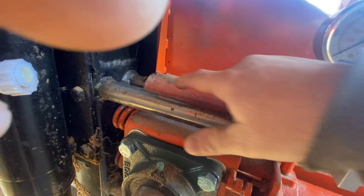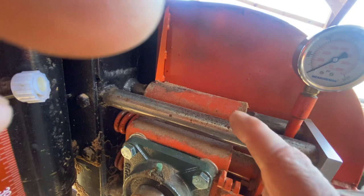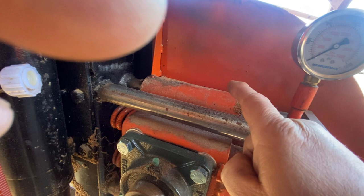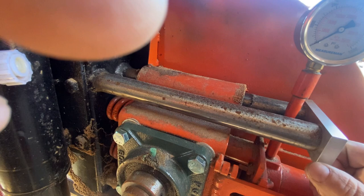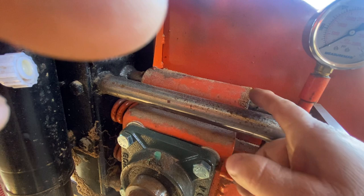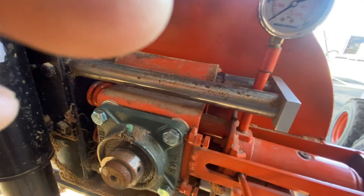When we originally made this, we had one shaft on one side with linear bearings inside — works very well keeping things parallel top and bottom. But under load it was pulling the head unit in that direction, and even though it was very minimal, I was concerned. So we added another rod and tied the two together, which helped share the load between the two rods. That was kind of an afterthought design, but it works very well. If I were to do it again I would have more linear bearings on both sides.